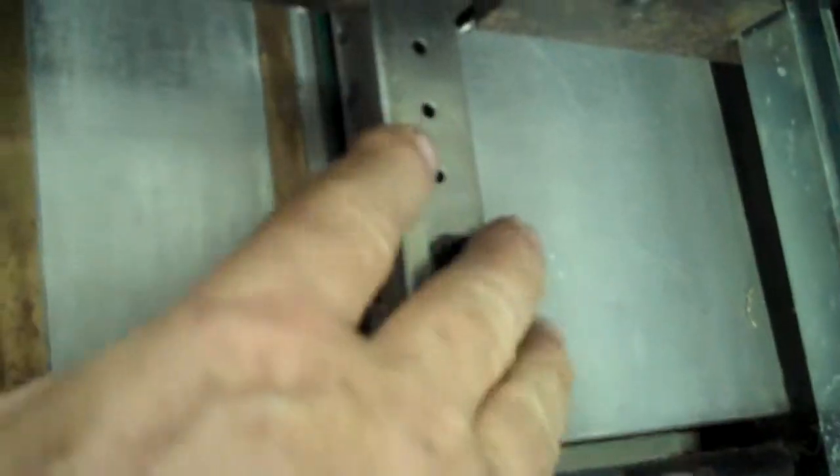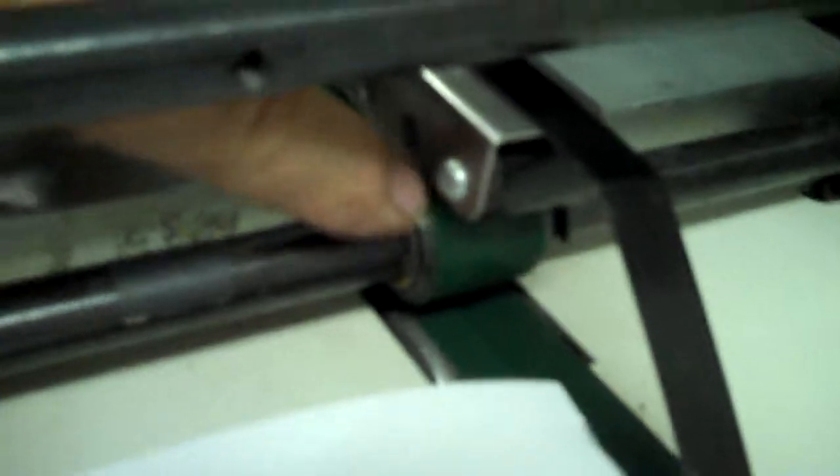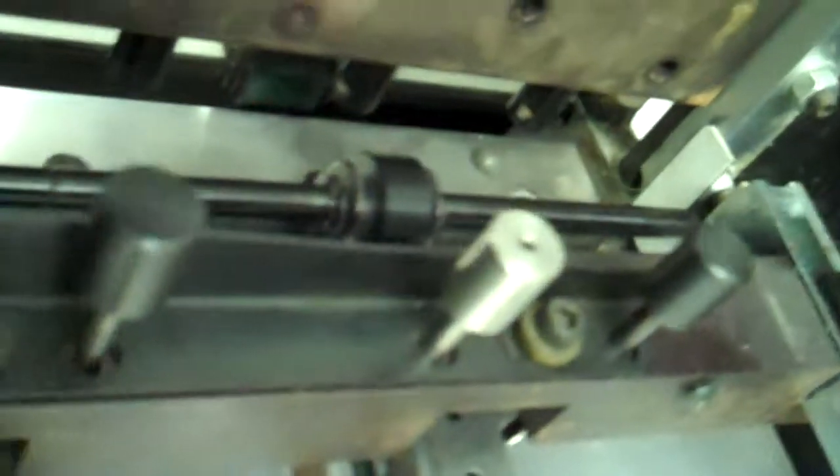Now the exit is another issue on the trimmer. Now if you're not going to use a trimmer, it makes it simpler, but these transports here will have to be moved closer to the center, and the belts that go underneath the same way. You have to loosen the set screws on the drive pulleys of the green transport belts and move them towards the center.